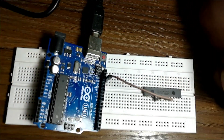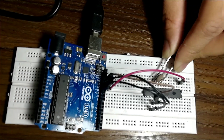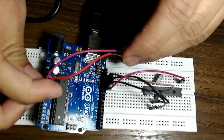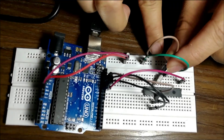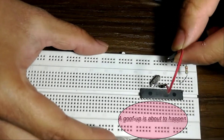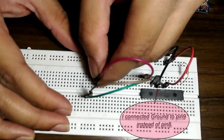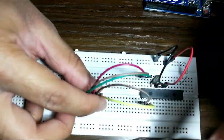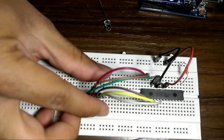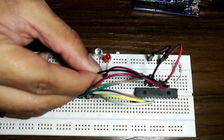Once I was sure the microcontroller was behaving as expected, I began making the electrical connections to program the microcontroller with the code to operate the ceiling fan. During this process, I made a mistake and connected ground to pin 9 where the crystal is connected, instead of pin 8 which is ground. I didn't notice this in the beginning and wasted time on such a silly error. So make sure you cross-check your electrical connections after every step to avoid any hazards.